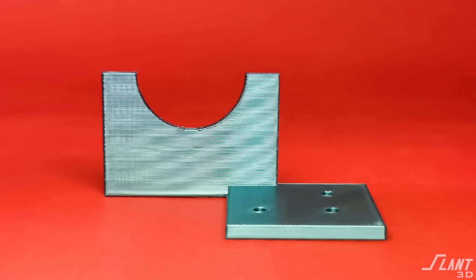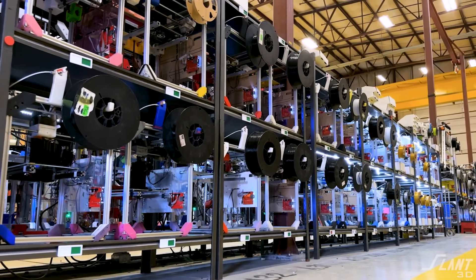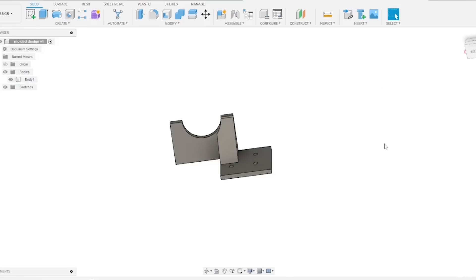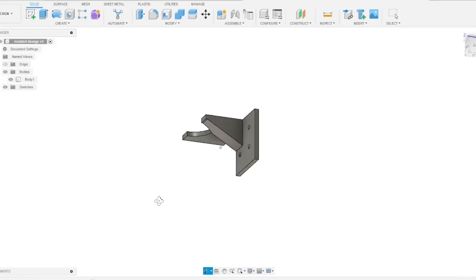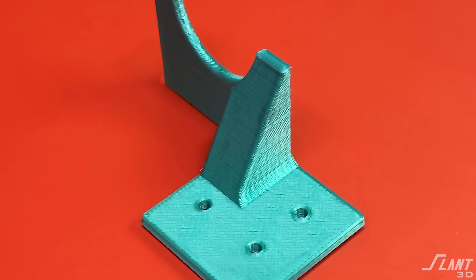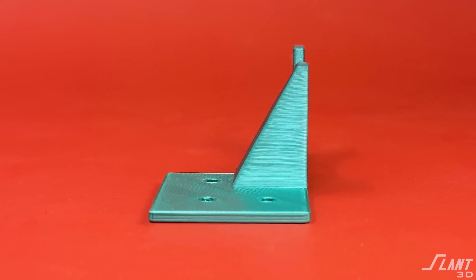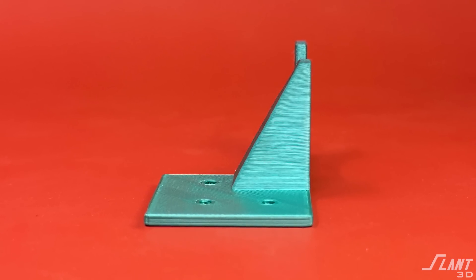It's best if you actually design the part for the process. If you're starting with a simple injection-molded part and trying to get it mass-production 3D printed at a large print farm, the first thing you should do is optimize the injection-molded design for printing. The biggest solution is to put a big fat chamfer there — blending those pieces as much as possible, merging the surface area of the vertical component with the bottom component. You can also use lofts and blends so that you get a really thick area that serves as an I-beam against the breaking force of the layer lines.